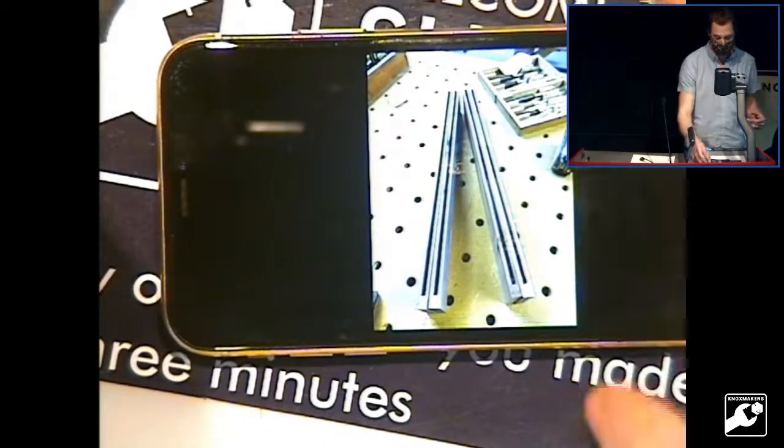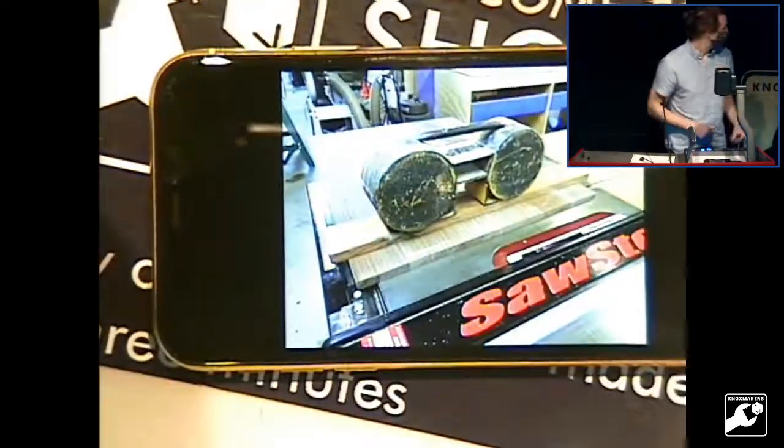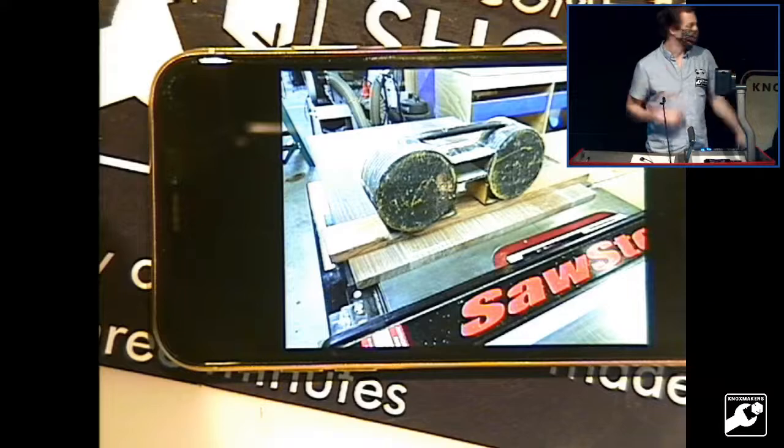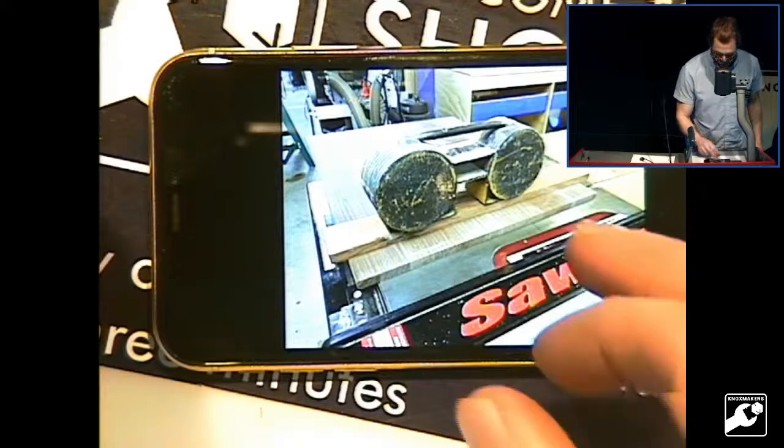Now you make breadboard ends so that it will hold a panel flat. And so here I am cutting the first parts of the joinery for the breadboard ends, and I had to put these big weights on it as I ran it through the table saw to bend that flex back out of it. If I had just cut these at the time that I made the panels in the first place, it would have been super simple, but I just enjoy complicating my life.